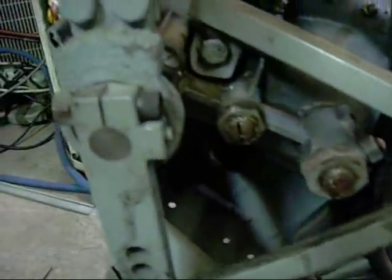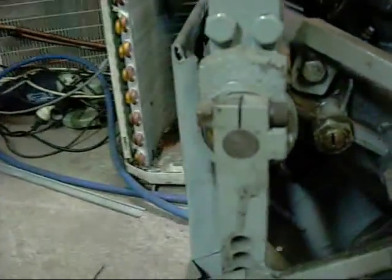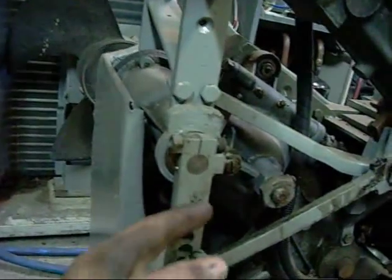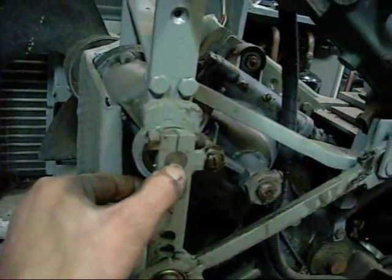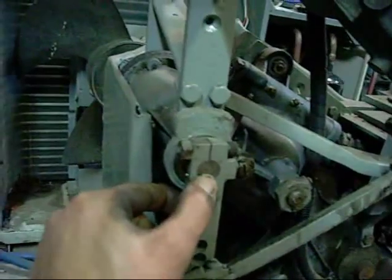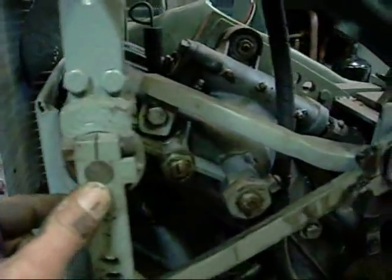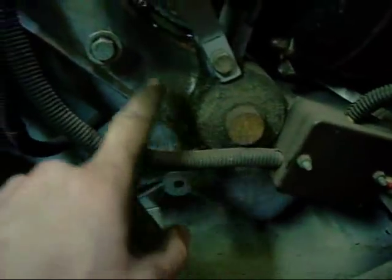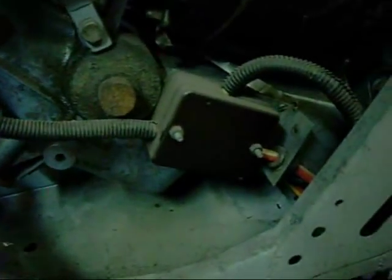This is the wringer drive up here. This shaft actually used to extend all the way up to the top of the machine to drive the wringer — that is why it is running at such low speed but very high torque. All the gears and things have been removed from this part of the gearbox and it is blanked off; it has got wooden plugs and is basically just an empty casting down the bottom.